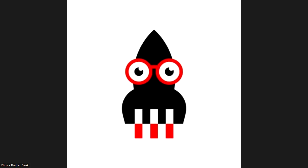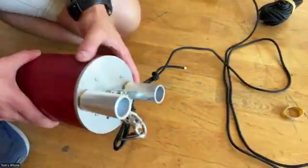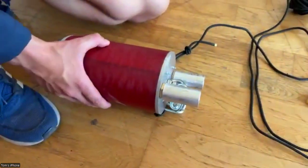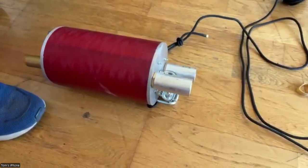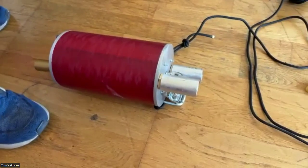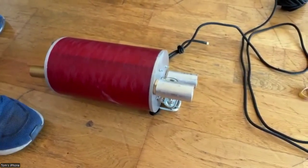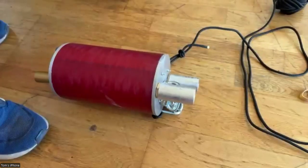That just has to slide into your tube, right? Are you going to bolt that in, or how does it stay fixed in the tube? Correct, yes, so we've got a retaining ring. It's the same idea as a coupler, made from 8M4. That's getting made this week. We attach that to the bulkhead and then we bolt it in so it won't come free. It also stops any spinning of the bay. That'll center one of the bulkheads as well at the same time, inside the coupler tube.